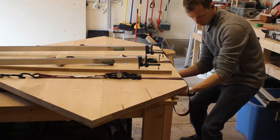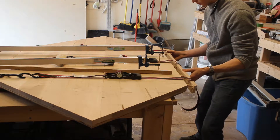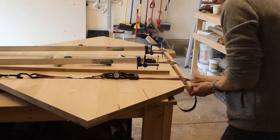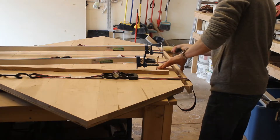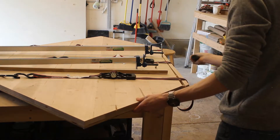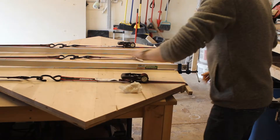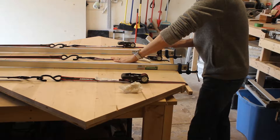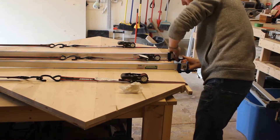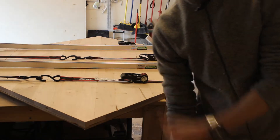The clamp-up for putting on the apron — I did make sure to record this one. It was actually a very difficult kind of clamp-up. This is what I call the Superman corner — the shape is kind of like a Superman corner, but it's 70 inches all the way back, so it's a really big clamp-up. I actually only had two clamps that could reach that distance, so I ended up using tie-downs for this. I used a soft mallet to hammer in the actual apron around it, and then I put on a sacrificial piece of wood to sit in between the clamps, the actual maple itself, and all the tie-downs. With the kind of pressure that you need to do something like this, it's very easy to damage or imprint either the clamps or the tie-downs onto the maple apron, so I made sure to put something that I didn't care about — some kind of sacrifice.